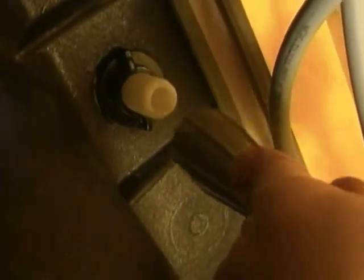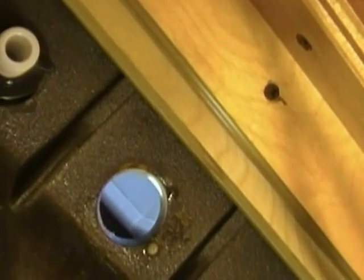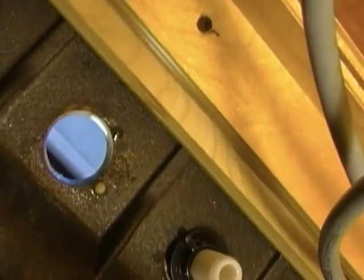Alright, so let's go underneath, take a quick look. Hold on just a second, I want to show you this little special tool that they provided with the kitchen faucet. As you can see, let me get the camera arranged here. Right up here where I'm pointing with this tool, these are plastic lock nuts, and this little tool fits the little slots, so you can hand tighten both of these plastic nuts up against that base plate up top. That's all you do, just hand tighten those up, and that'll squeeze any excess plumber's putty out of there. And so that's ready to have the faucet installed.